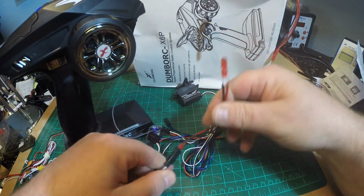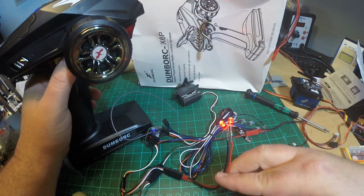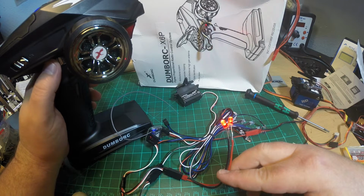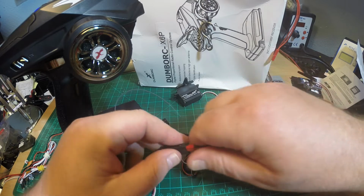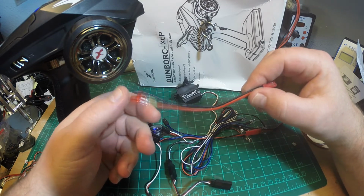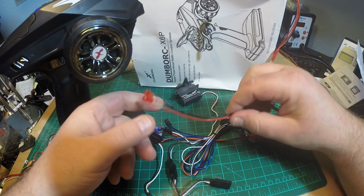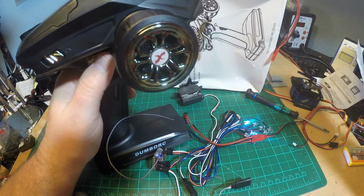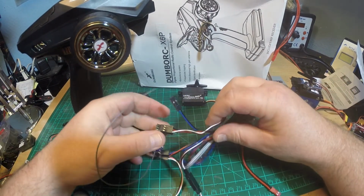Come on. Okay, so check this out now. The red LEDs will work, but the white ones not. The white ones need 3 volt and the red ones 2 volt. So unfortunately it's not possible simply to plug red and white LEDs in parallel. Rear lights red and front main beams in white, and switch on off the light that way. And you see the reds are gone and the whites work again. So not really happy with this. Really, really not happy with this.